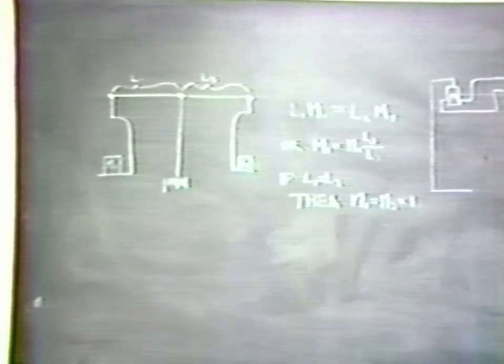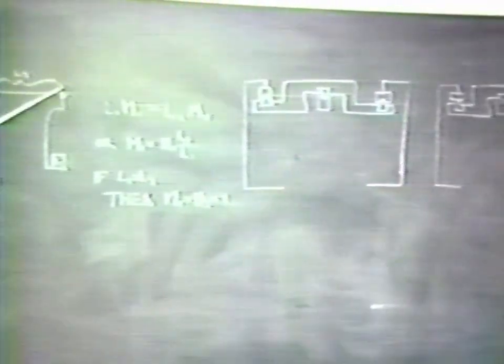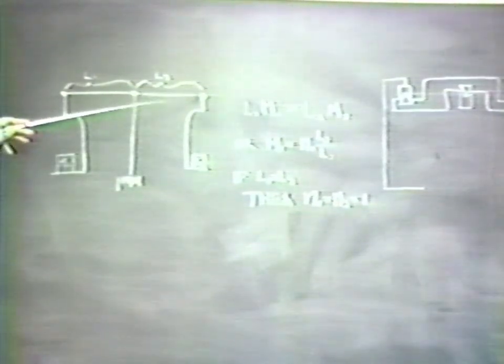However, in order to obtain precision, that is, reproducibility, and to obtain this precision within 1 part in 10 million, we must examine the construction of the balance which will allow for this precision. Therefore, let us examine various types of construction of equal arm balances. We have shown here rudimentary pivots of perhaps cylinders.